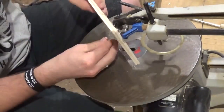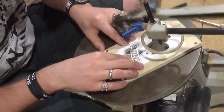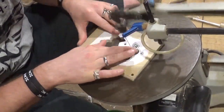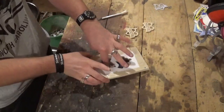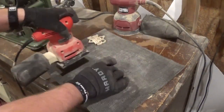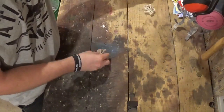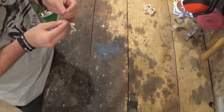Done with the first two — I'm going to pop them out and get the last two cut out and released from the wood. Just taking my time and following the lines. Now I'm taking the pattern off, which is simple with the clear packing tape, and getting these four beautiful hearts ready for sanding. I use the palm sander with a very light touch on each of them — you don't want to break them with heavy sanding. Then I threaded the short key chain through the eye hole, hooked it, and the project was done.